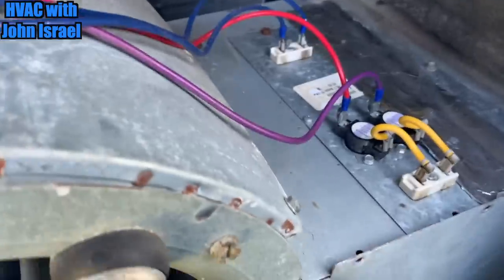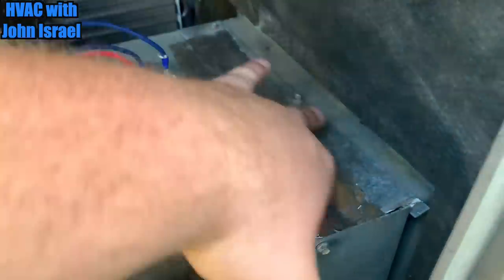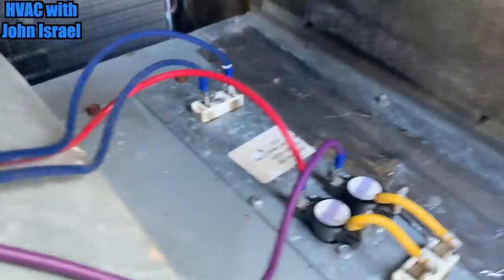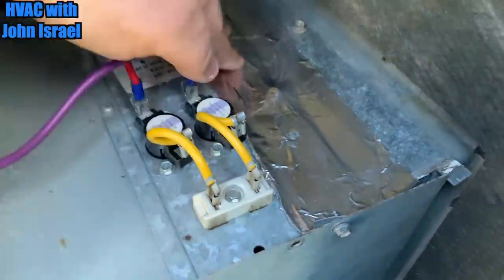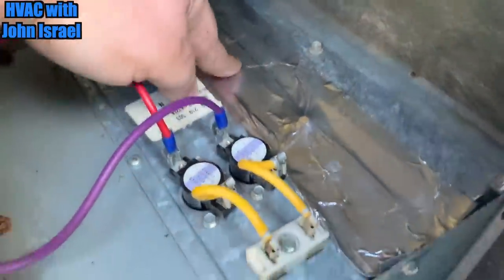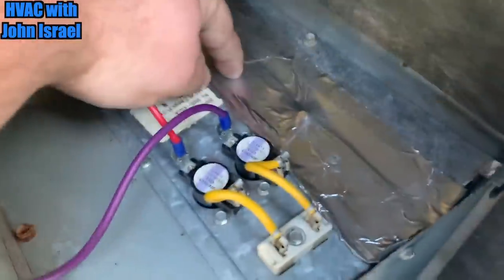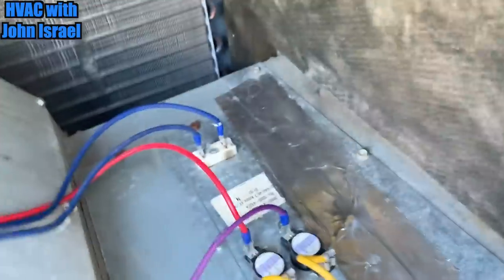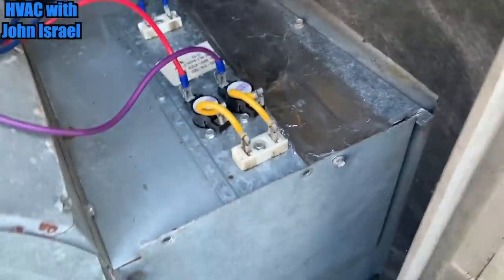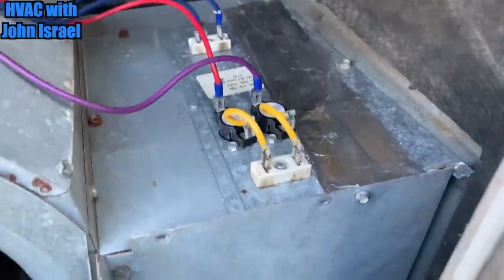This is not really the most effective way to do it, but it's the only thing I could do. You can see I put a screw here, I got a piece of sheet metal laying over that crack, and another screw here, and another one back here. So there's a piece of metal there and I did stick a piece of foil tape over it to try to stop that air from escaping. Hopefully now the heat strips won't cut on and off — but somebody has been in here messing with this unit.